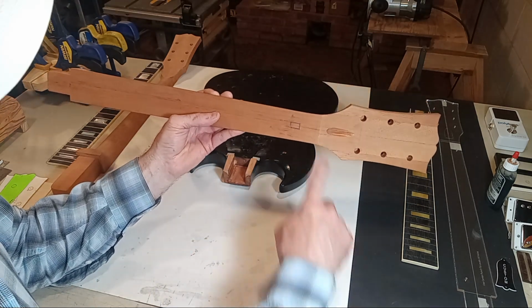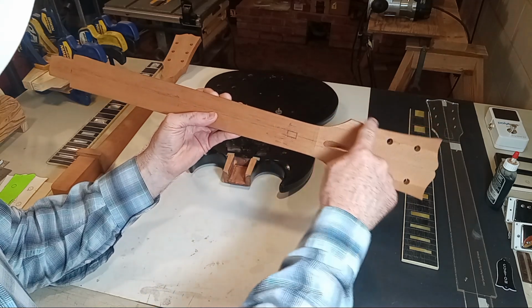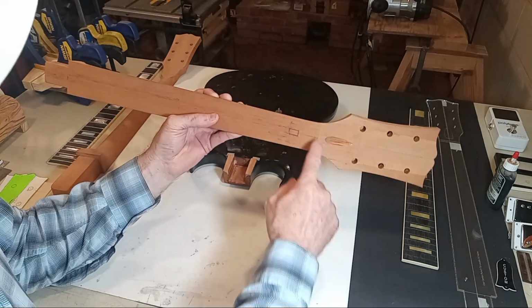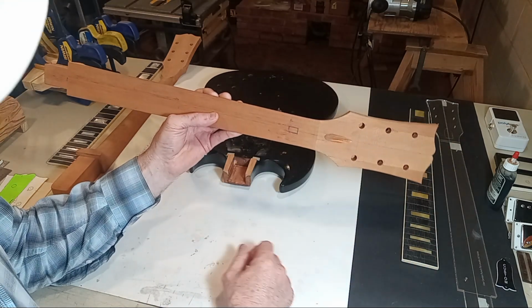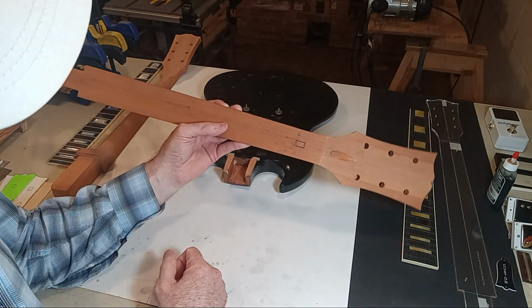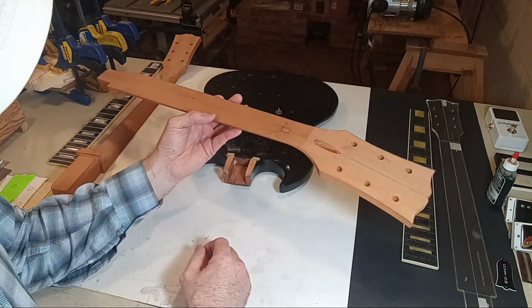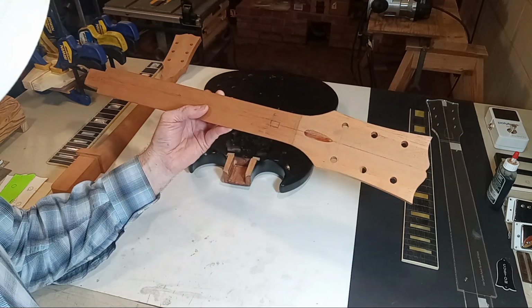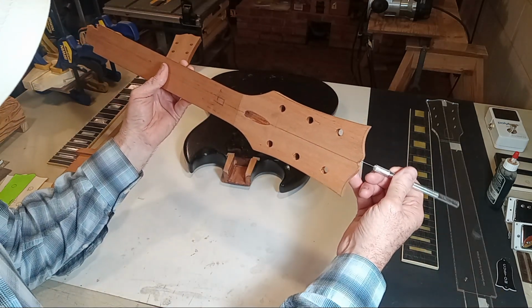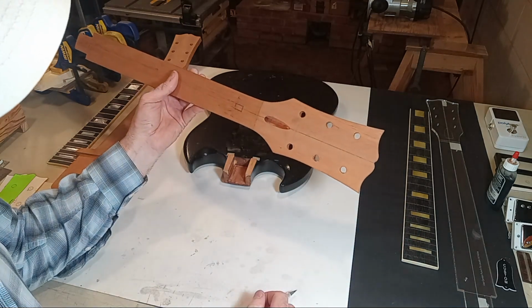And in case I forget, I want to make that 14 degree cut before I start doing all this shape work. When it's still S4S or rectangular, I can then trust a straight line on my overlay to go to my miter saw and cut that 14 degree. But that 14 degree cut will be based on a certain finish dimension right here. So you see how, and even making certain that you keep all your binding thicknesses and stuff.